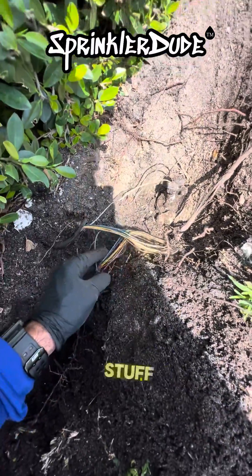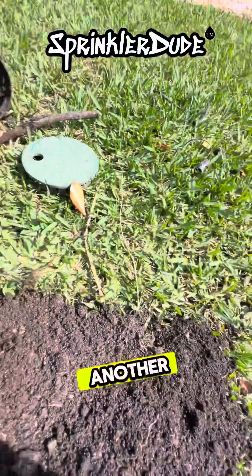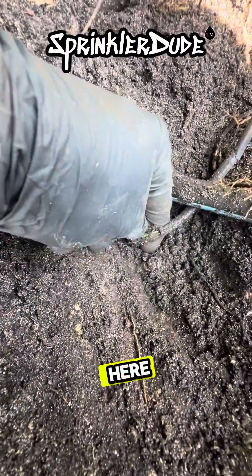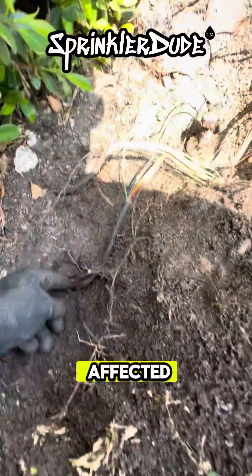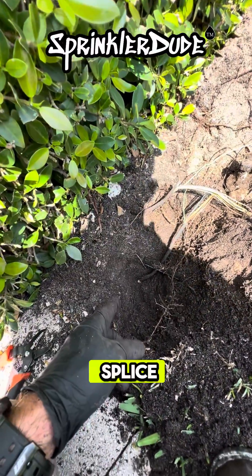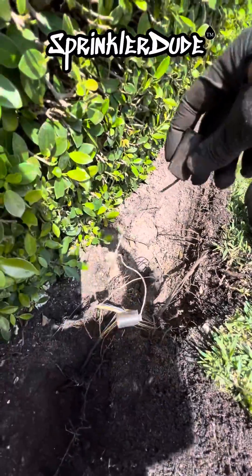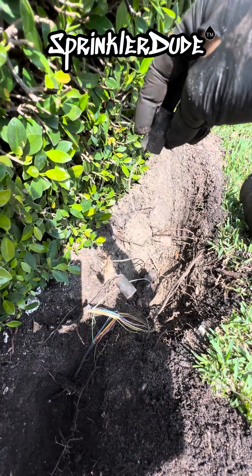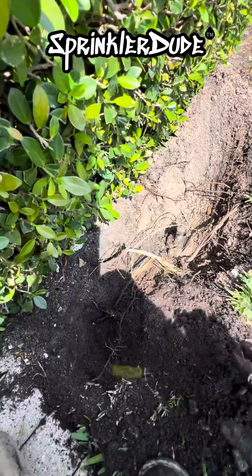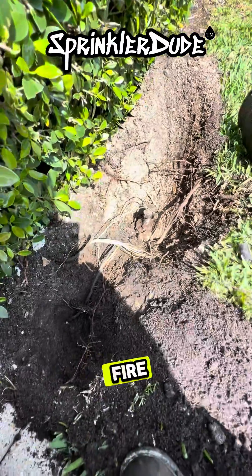That didn't work, but I found some more fun stuff. I started pulling on the common wire out of this and it came right out. There was another one around here — I pulled it out too. And that's because this wire was cut right here. So the common was affected — a bunch of wires got cut in this one spot. I'm going to dig up a little bit right here, get to those wires, and I may have to make a new splice right here so I can bring them back over to the valve. In addition to that, I also found more wires glued together, which could be also why we're getting mixed readings at the controller. We're going to clean this up — it's definitely adding to our problem — and see if we can get this valve to fire from the controller.